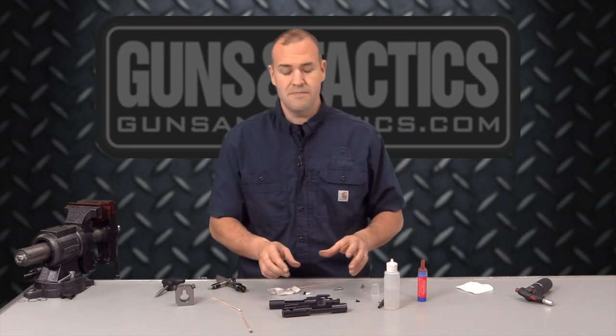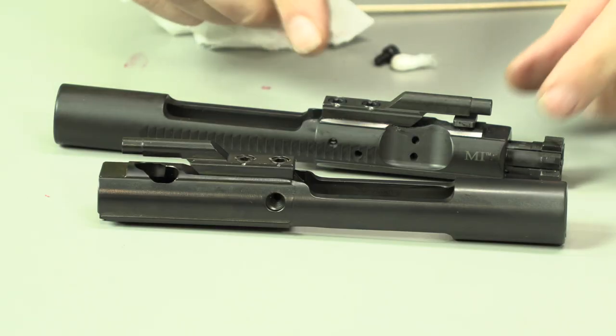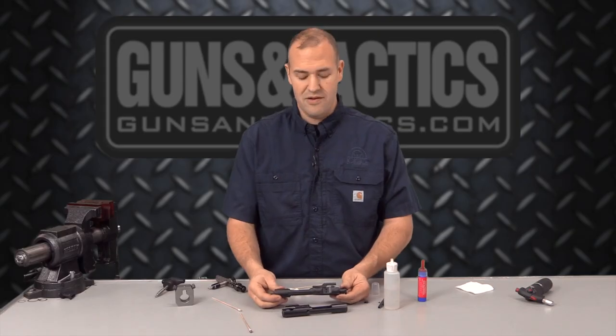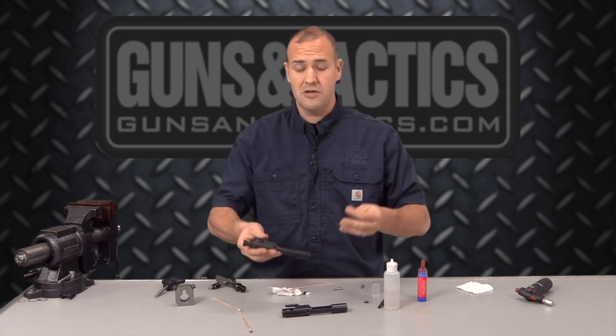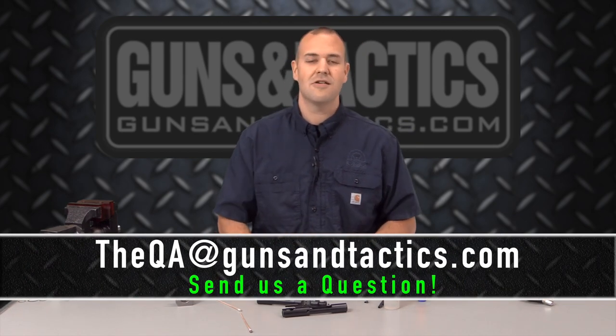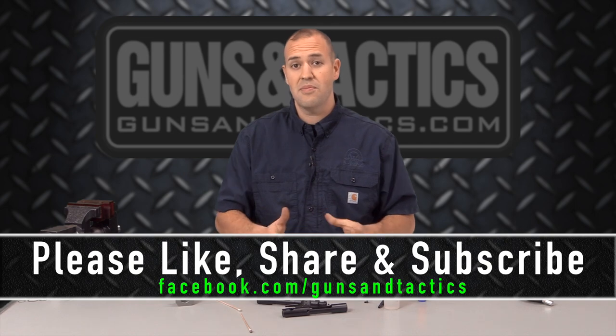That is gas key carrier replacement 101. We removed the old carrier, cleaned it, sealed it, properly torqued down some good quality screws, replaced it with a good quality carrier, and did a nice staking job. Now this is ready to be lubed up and put back in the rifle and hopefully give great service life to Uli. I thank Uli for sending his carrier to us and making a video on a learning point we can all learn from. If you guys have any questions, be sure to leave a comment in the section below. We also have a monthly Q&A series — that's our mail call segment — and we give away prizes to one lucky question asker every month. You can send an email to qa@gunsandtactics.com or leave comments on our social media. Thank you guys very much for watching and have a great day.